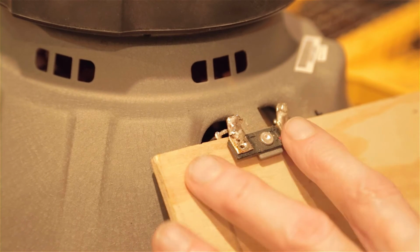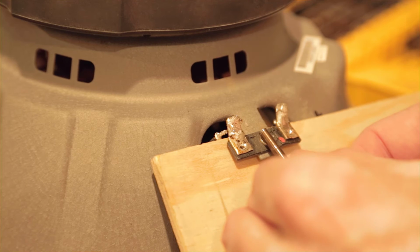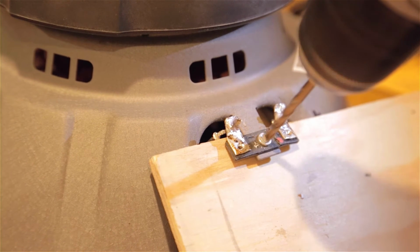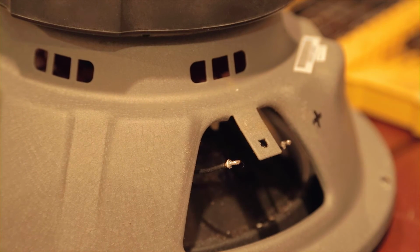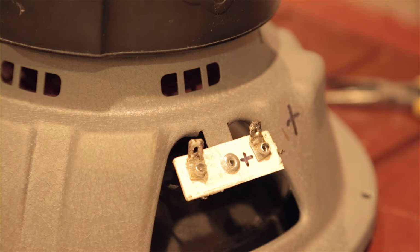So I put a piece of wood in there to keep me from slipping and going into the cone, of course, right? I got our pilot hole started, so now we're going to get a proper size drill. Let's see. That's probably a good size. You can always drill it out a little bit further if we need to. We're going to go ahead and drill out all of these since we're drilling. This one I've repaired already, of course, once, and so I don't know that this drill size will be adequate. I'll have to use a little bit bigger drill for this one.